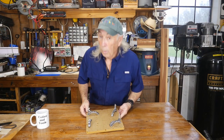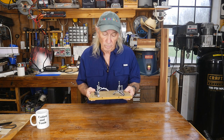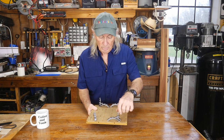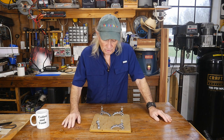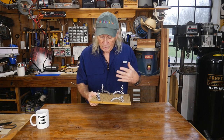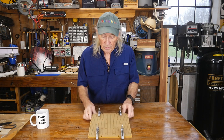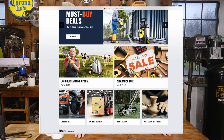This past week we did a review on a Snapmaker and did the three different things — this was the CNC spoil board for it. These little clamps use metric screws, and the spoil board had some dirty threading that was making it impossible to get the clamps in properly. I wanted to clean the threads but I don't have metric stuff, so I was stuck setting the clamps a certain way. The threads were just a little dirty or maybe not made well on the machine. To clean the threads would only take a second, but if you don't have metric, you're stuck.